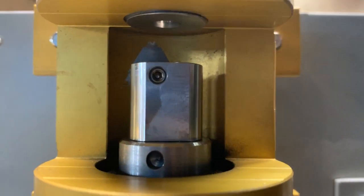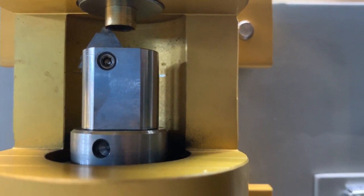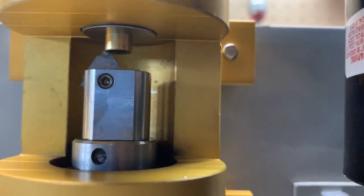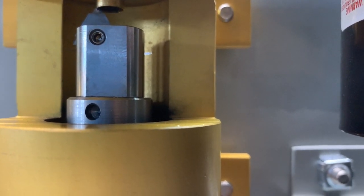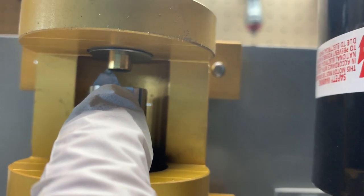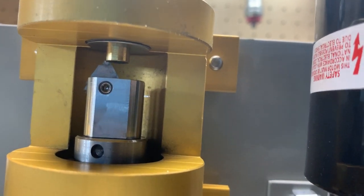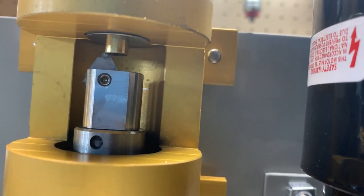The cutting mechanism — and this is going to be hard to see — is a little triangle blade right up in there. The goal is that when everything is set correctly, you can see how it fits right in the little valley of those two mountains. As it spins around, it's deburring, chamfering, and trimming all at the same time. You can adjust with this little screw — it lets the blade go left or right so you can center it depending on where you want to cut.